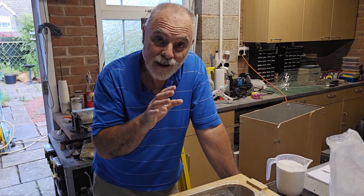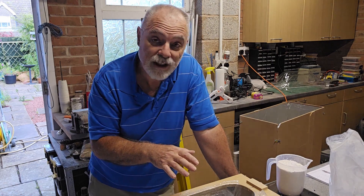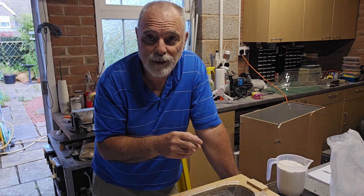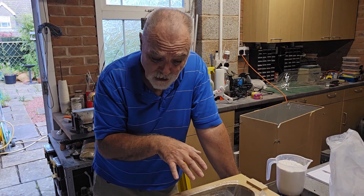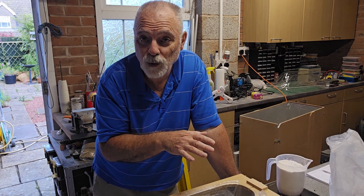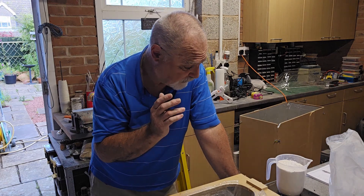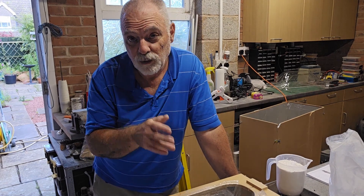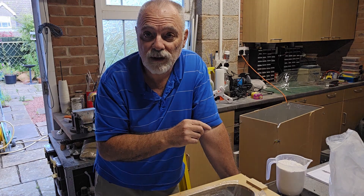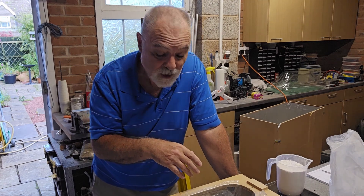First of all I'm going to use Herculite number two, which I got from East Coast Fibreglass. It's like a dental plaster of Paris — very fine but hard — and it's great for this, and it goes off quite quickly. The mould takes 2,200 millilitres of water, so 2,200 grams is the weight, and the mix ratio is 42% Herculite to water, so I've got to mix 4 litres — 4 kilos of powder — to the water and then pour it into the plug. I'm not very good at working out ratios so hopefully I've got it about right!